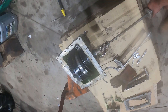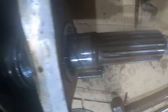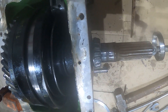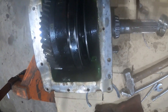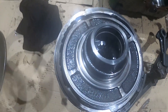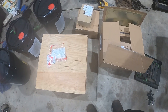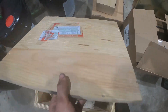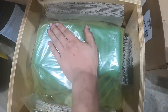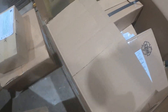Them black bits on the top of the three bands is the handbrake. The shaft has actually sort of welded itself into the pack. So I've welded enough to undo the shaft — put my slide hammer on it and pull the shaft out. There is the bearing housing at the back. There's all the bits, there's the barrel spring. All that housing is knackered, all the basket is knackered. You can't get a complete unit, so we've had to order all the bits individually. It's cost an absolute fortune and we've got to get it done.